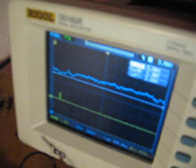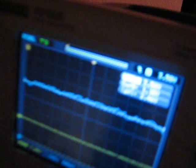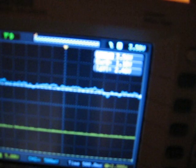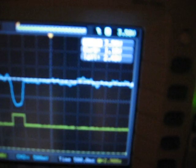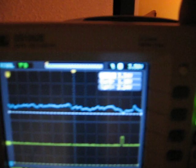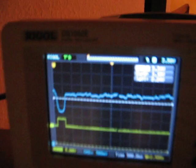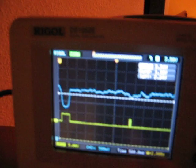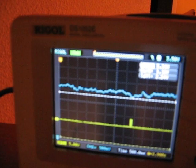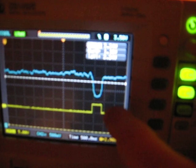The reference voltage is currently 3.35 volts. The voltage coming back from the photo transistor is above that. Here is my oscilloscope showing it — the white cursor line is at 3.56 volts. When you drop it to 3.35, you can see where the trigger voltage is, and that's one drop caused by the black spot on the disc.